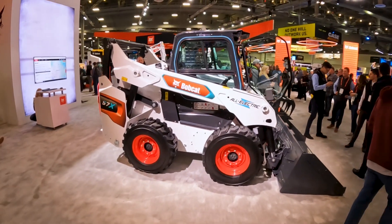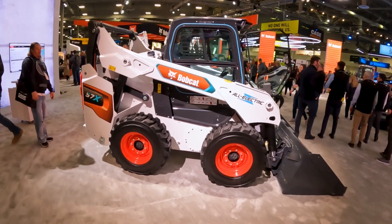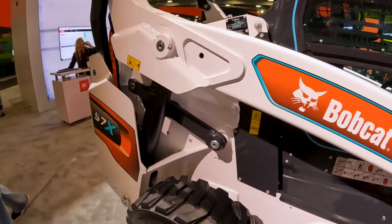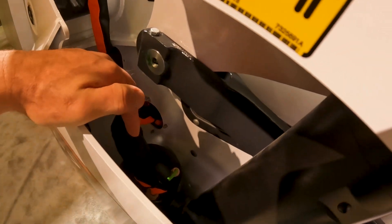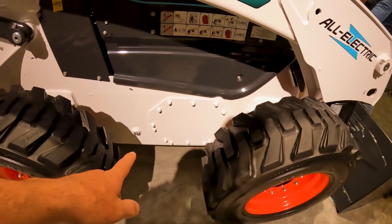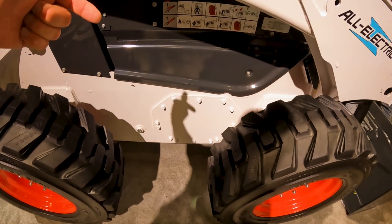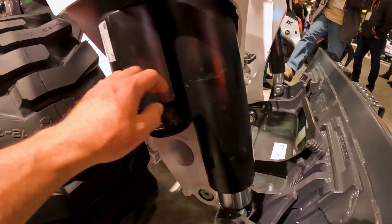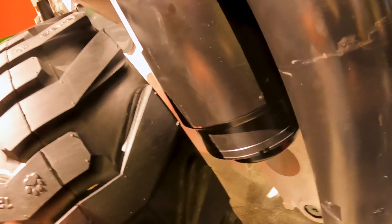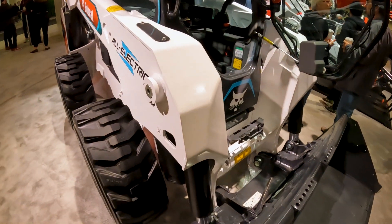Bobcat is kind of the leader in this electric skid steer — really the first in the world of this type of design. There are other electric-over-hydraulic skid steers out there, but what makes this one unique is that it is 100% all-electric. You can see these large rams here — ball screw actuators — with a large ball screw actuator and a three-phase AC motor inside the chain case. It's a standard oil-bath chain case like on other loaders, but with a three-phase electric motor. Even the tilt cylinders use ball screw actuators. This machine hasn't been released yet, and there may even be some design changes on the loader arm, being that it's a brand new concept.